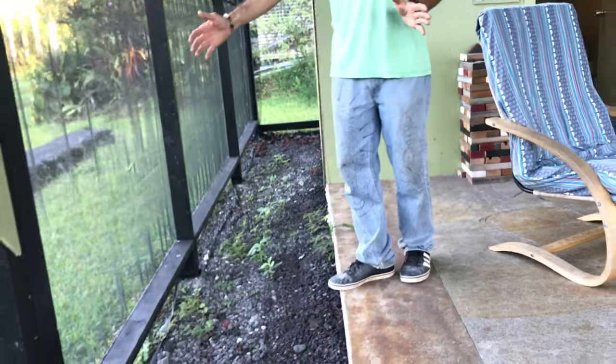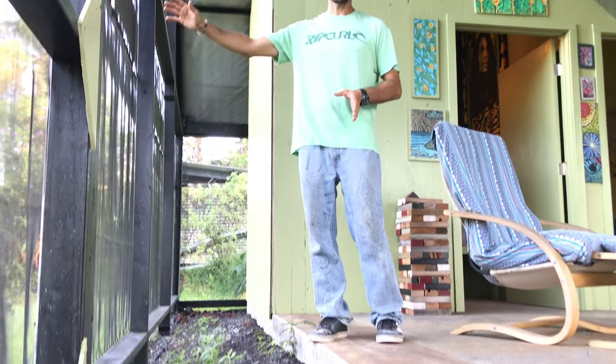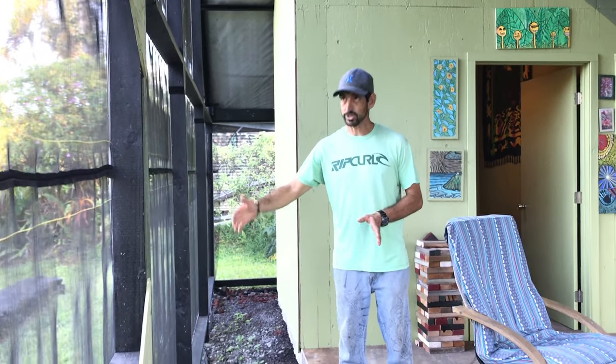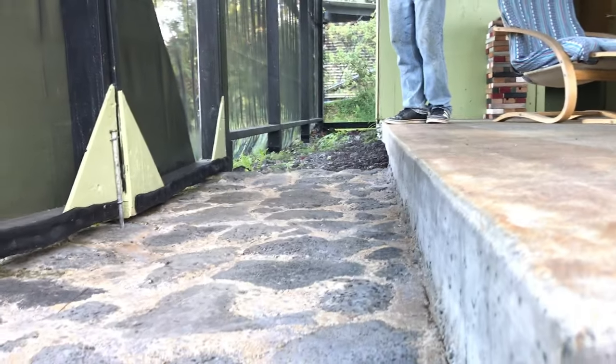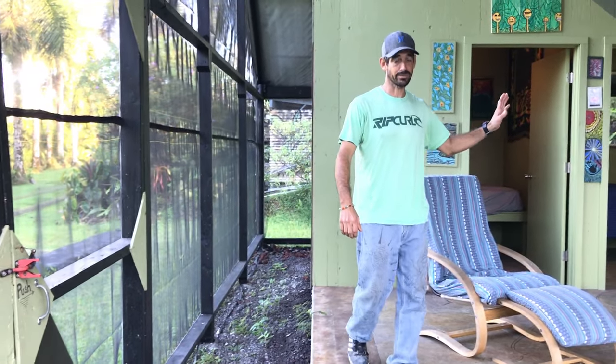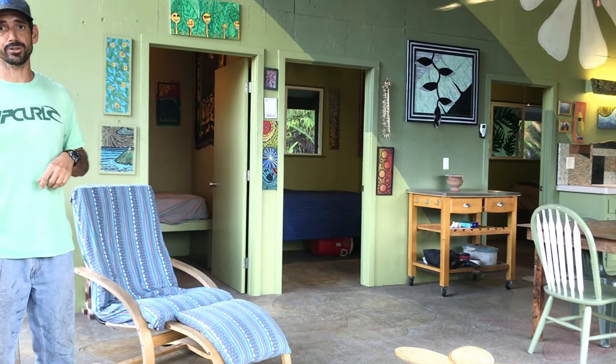Another feature to consider if you want to live in a greenhouse is the slab. This is a concrete slab set three feet back from the exterior wall. The reason is I live in a rainforest, and sometimes rain will come through the screen. If you give yourself an overhang, it won't hit the slab and migrate into your living area. On the backside there's also a three-foot setback, so on three sides there's a three-foot overhang. This also allows you to use conventional vinyl windows without worrying about rain and weather running down the walls.